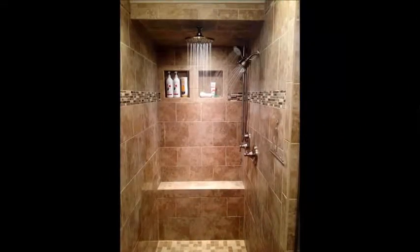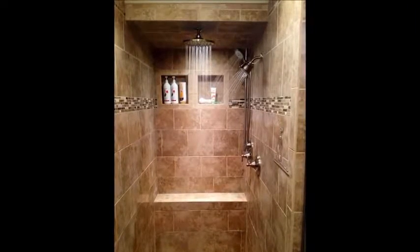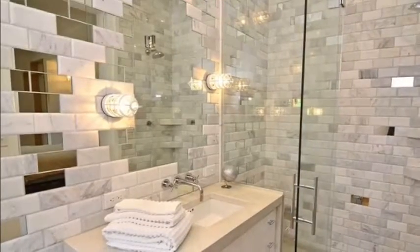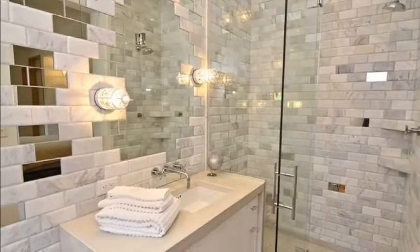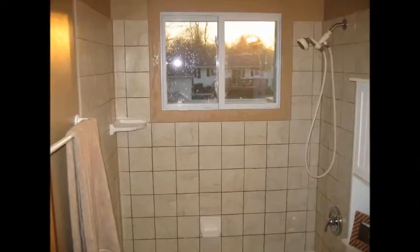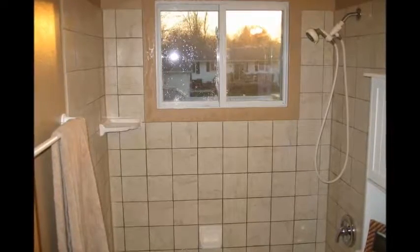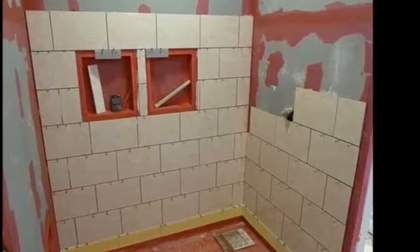Finishing up the job. Grout the tile. Mix up a batch of grout. Lightly wet the area you'll be grouting with a damp sponge and dump a bit of grout onto the area. Use a rubber float to smooth it into the joints, attacking each joint at a diagonal angle. After 30 to 40 minutes — check the directions on the back of the grout bag — wipe the excess grout with a damp sponge in a circular motion. Keep wiping with a clean sponge until the tile is clear. Let the grout cure for approximately 3 days before sealing. Then seal the grout. Run a bead of liquid grout or aerosol grout sealer onto the grout lines and wipe away the excess. Let it dry and test its water resistance by dropping water onto the sealed grout. Correctly sealed grout will cause the water to bead up on top of it.